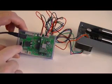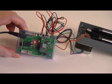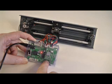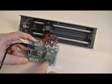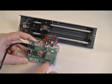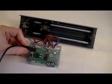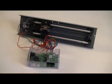Slide the switch S2 at the side of the motor tester board to the on position. Press the push button S1 on the motor tester board to move the linear bearing block forwards. Release the button when the bearing block reaches the end of the shafts. Press the push button S3 to move the linear bearing block backward. When you have finished this test, slide switch S2 to the off position. Disconnect the AC power adapter from the motor tester board.